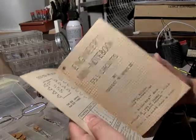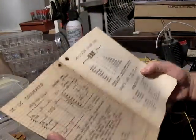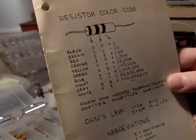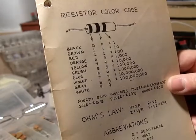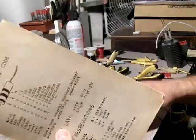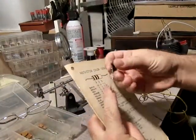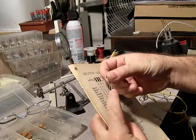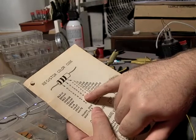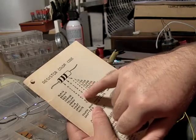The Engineer's Mini Notebook is good for the resistor chart at the end — I'll let you get a shot of this if you want to pause. So when you're reading resistors, let me pull one out here. We've got green, blue, red, gold. So green is 5, blue is 6, red is 100 — so that's 5600.